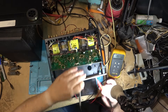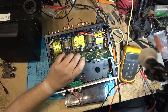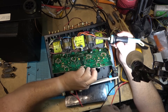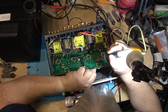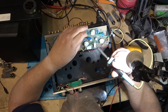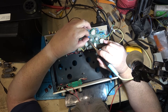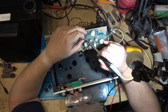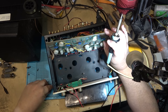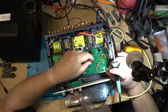Let me see what I've got. 224 is at 400. If I've got those caps I'll change them just for the heck of it. The power light fell out — I'll have to hot-snot that back in when I get this back together. What the heck did they do here? I see what they did — what a dumb way of doing this. I'll change these both out. It might be better to mount it on the other side of the board — more room over here. That's for sure. It goes across here, right?